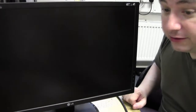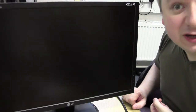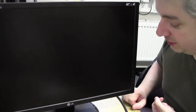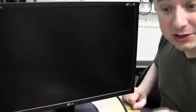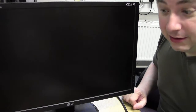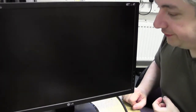We'll keep this running and see what happens. Okay, hopefully it will stabilise. The charge on those caps will come up to their values, and the screen should hopefully display a desktop. Now, I do imagine that this will be a problem with the electrolytics, where the ESRs are so high, the caps are so shot to hell that it's taking ages to get them charged up enough. So that resistance goes up internally. That charge time is just going to go through the roof.